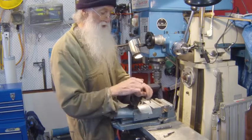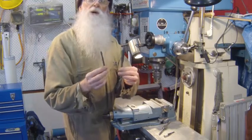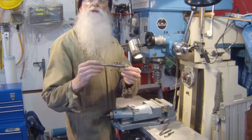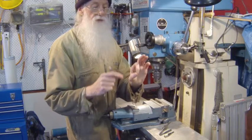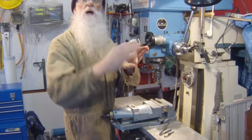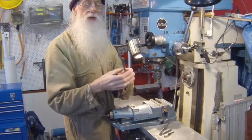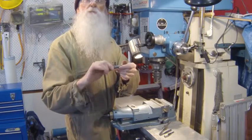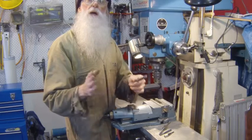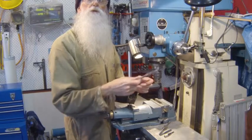They come in various sizes, from small to very, very large. But another benefit of them, and they are very versatile this way, is that they're also a great expanding mandrel. Just say you've got a disc and you've got a hole and the outside was rough or it was an off cut, and you put it on the lathe and you could only face it off and do the hole and the rest is still out. You just slide it in and nip it up. Again, slight cuts, and then that will be strong enough to hold it, and then you can machine it up until you get it concentric to fit in the 3-jaw chuck or whatever.